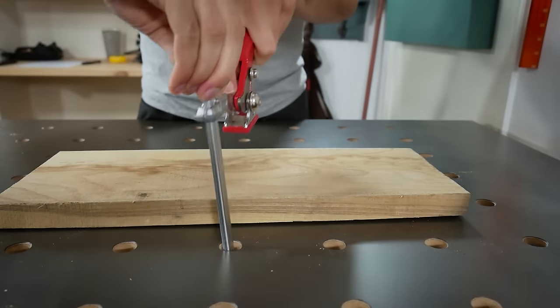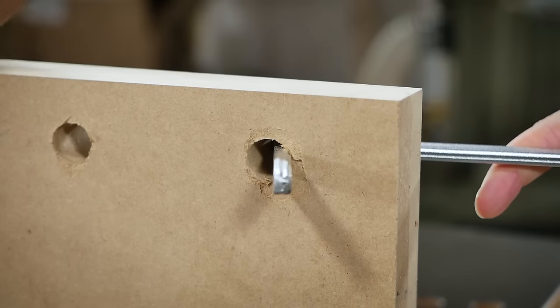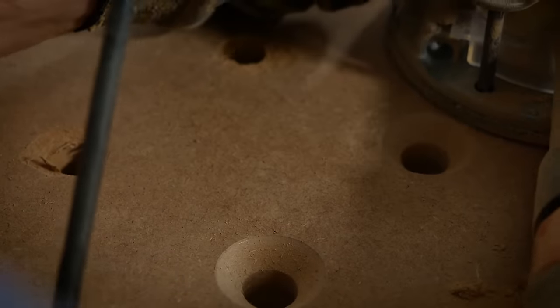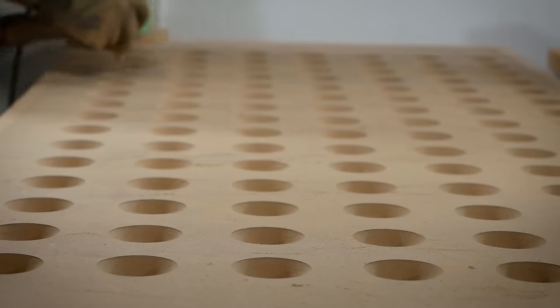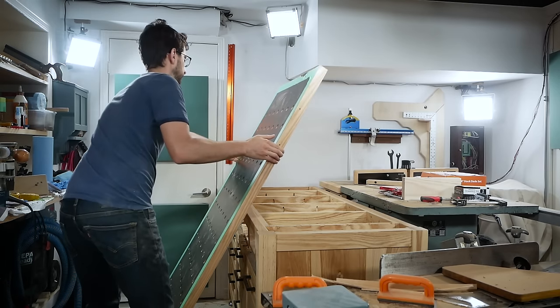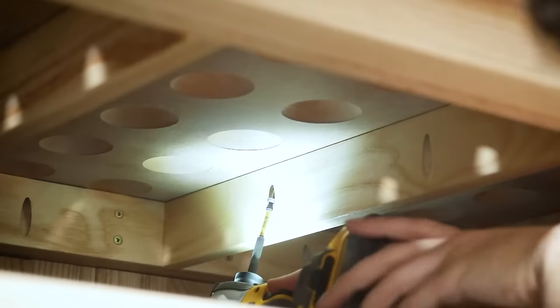I find they're way more secure than others, but these only work if they're going through about 3/4 inches thick of a benchtop. Otherwise, they can't make the turn. They just get stuck. By making a 3/4 inch humongous chamfer, it effectively reduces the top to about 3/4 inch just around the hole. It's called a compromise for a reason, people. And now the top is done and is way flatter and bigger than my old bench top.